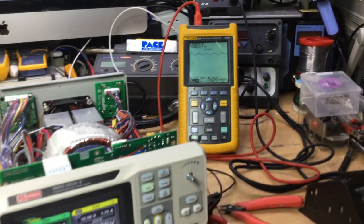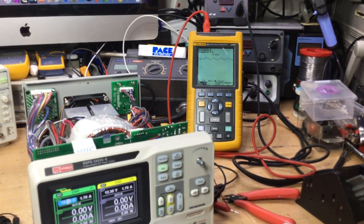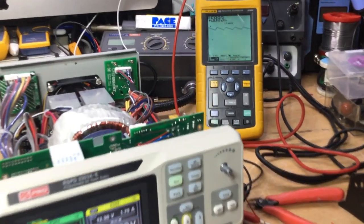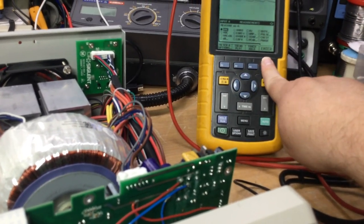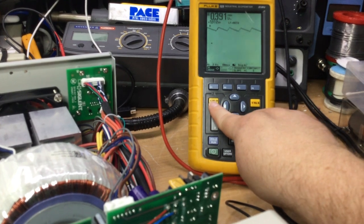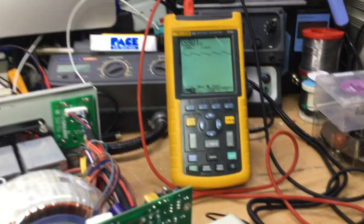And now we can see the sharp decline of voltage on the output, but yet the 5 volt AC input's still there at 50 Hz. And yet the output ripple is markedly seen there at the top. Now, interestingly enough, if I do volts and then AC, how many volts AC is the ripple? So looking at 390 millivolts AC, ripple at 100 hertz there on that measurement of the DC output. And yet the DC output is at 5.9 volts.